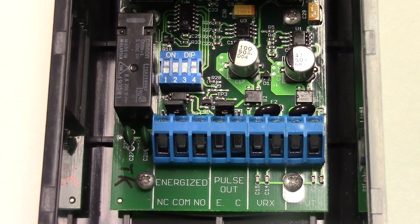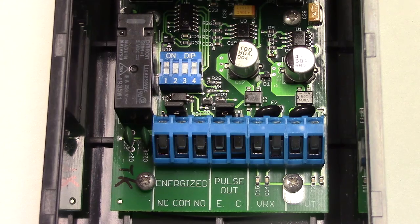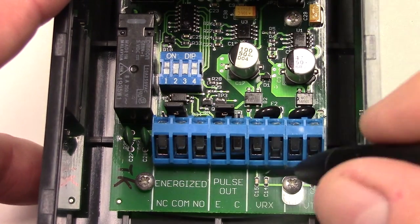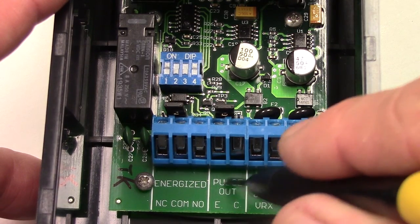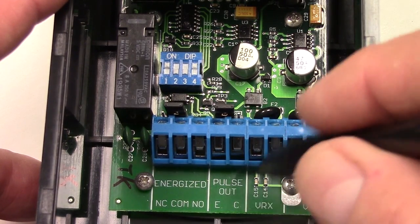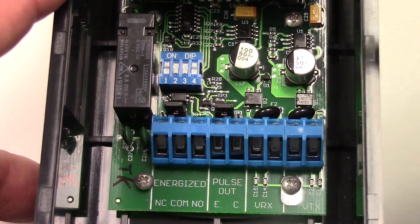Position one provides the two-wire pulsed output. The pulses run at either 300Hz or 0Hz, and the pulses can be routed either to ride on the power supply lines or available at the pulse output, which is isolated for a four-wire pulse.